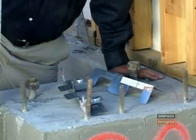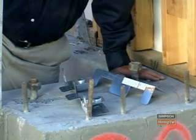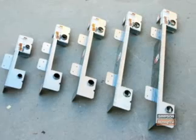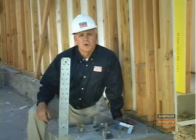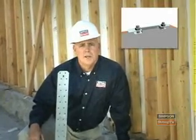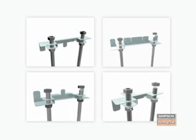Anchor bolt placement is crucial to the proper installation of any Steel Strong-Wall. We have designed several easy-to-use templates to ensure proper anchor bolt alignment. Templates are available for each different wall width. In the following segments, you will learn how to use the concrete templates for the following applications: standard wall, panel form, brick ledge. The installation sequence is fairly similar for each template.